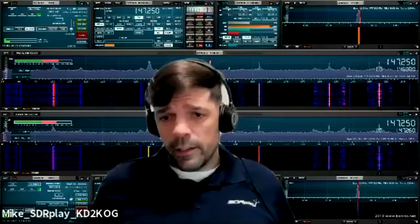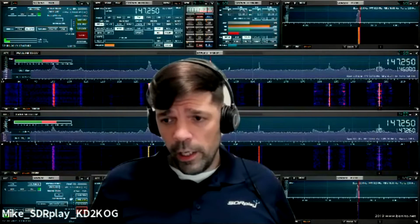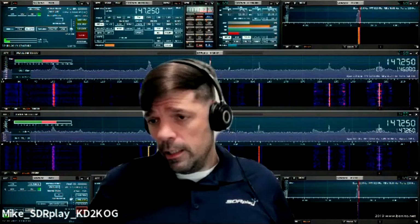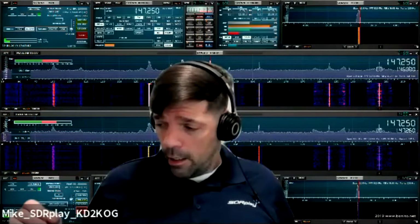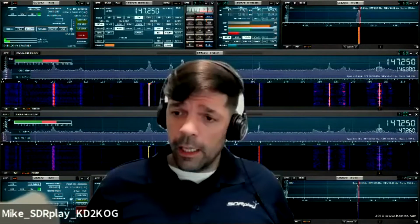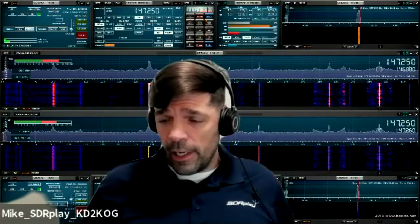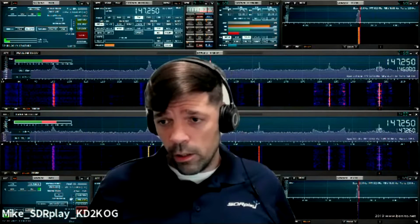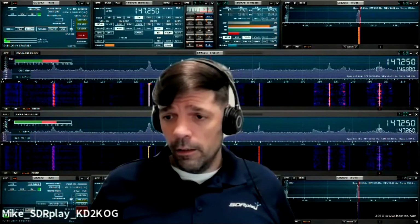Most important thing is if anybody's going to use an automatic RF switch, make sure you're sending it the PTT signals. This way, when you push the talk, it triggers the relay in the device. They have RF sense, but that is your backup device. Never use RF sense to switch. Always use the PTT line. Yeah, good advice. If there aren't any more questions, maybe Andy can go on to part 2 of the movie.